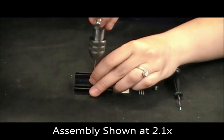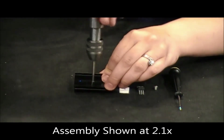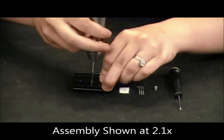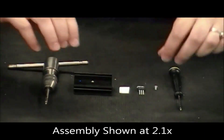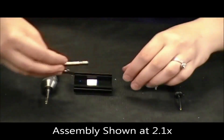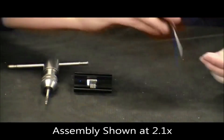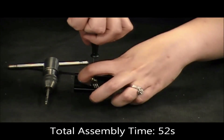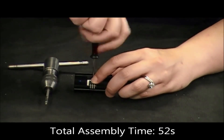Let's try that same assembly again, but with a screw and tapped hole. It takes more time to drill and tap the heat sink before placing the thermal interface material, and additional time to screw the device down afterwards. Even in production, automating the process may speed these actions, but there are still extra operations for every device placed.